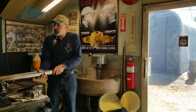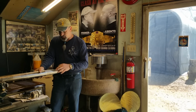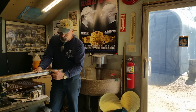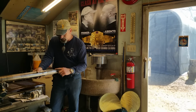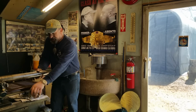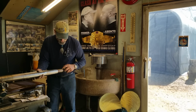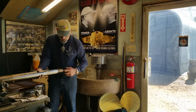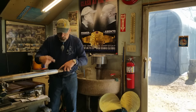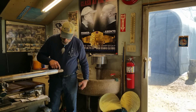Okay. We're going to do a little dressing up on the end of this before we start lapping. This is a very sharp edge right here. Now they let me know that these wheels were loose, and I can see that there were some marks here and there's hardly anything down in here. They also had some problems, and the nuts won't go on here very far, and I can see a little deform of the threads here. They were left sharp, and when they were driving this off, the keyway was stuck in the prop and loose in the shaft. And it ran up here and they rolled these threads over.